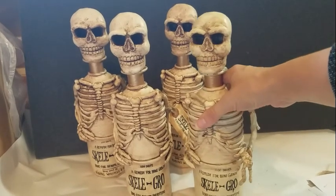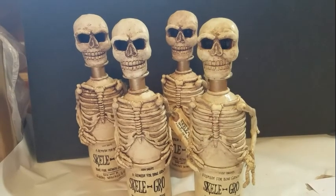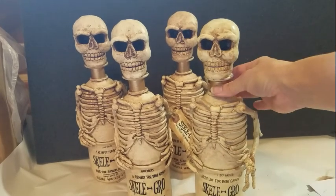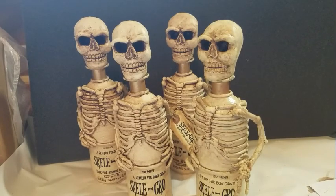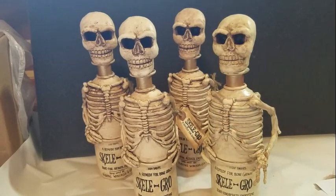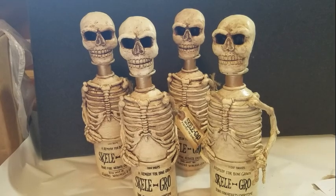So I was trying to figure out how I could produce these and be able to ship them. What I came up with was making a mold of it. I used a two-part silicone mold — I won't get into the details of how I made the mold because that will just make this video too long. I decided to cast it in a two-part urethane plastic and used SmoothCast 300 series.